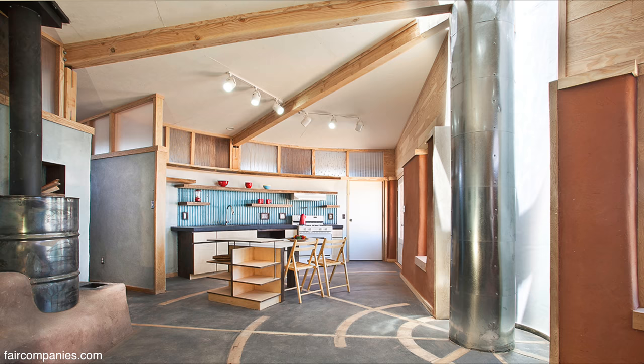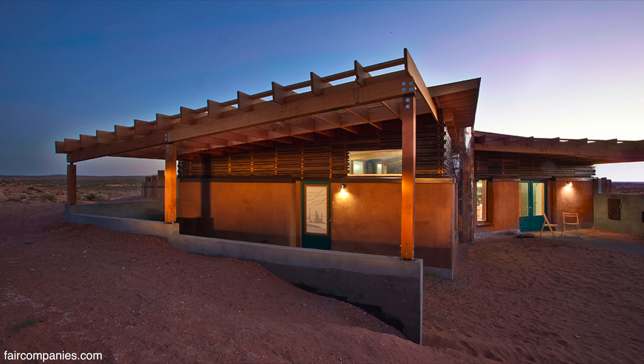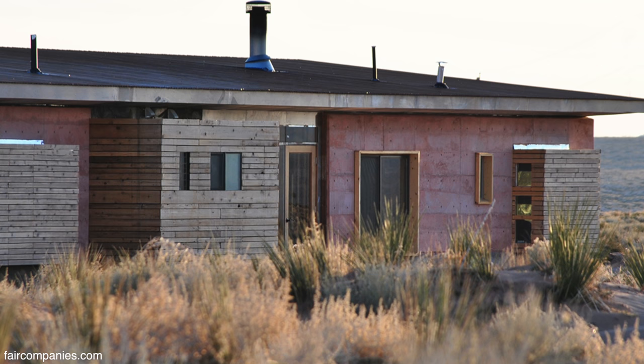I came to Design Build Bluff in 2019 as a volunteer builder, and I was really intrigued by the way that they were using natural materials in a contemporary way. All of the projects include some natural plaster, and the plaster is usually harvested from the site, usually the material that's dug up from the foundation. So all the plaster every year is so different, and it's a reflection of the soil that the building is sitting on.